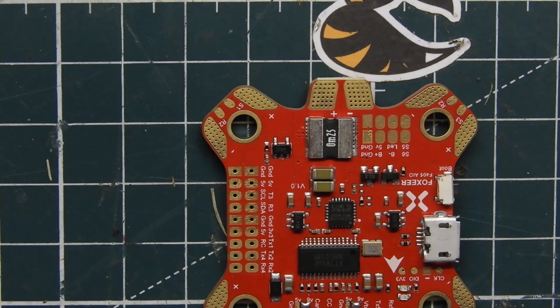I usually just hook up my cameras directly to the transmitter, so I usually don't even bother using these. We have our camera input and then CC — that's for camera control. That is kind of getting outdated now; the way you used to take your OSD plug and solder it onto this pad, but now you're actually using UART — they have UART transmit and receive pins on their cameras to control the camera. And if you have the OSD option with a little OSD, usually it's a blue wire coming off of it — that's where you go ahead and solder it right there. Then we also have another ground, and over here we have five volts or nine volts — again bridged with nine volts. And then we have our VTX, which is where our video transmitter would get hooked up for video. And then the camera over here is where your camera video feed goes in, so you get the OSD.